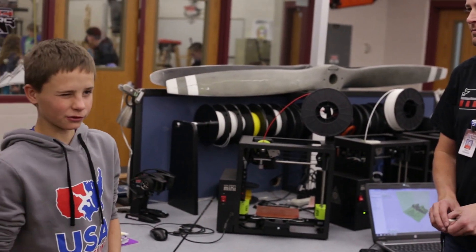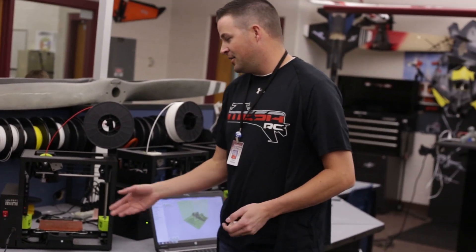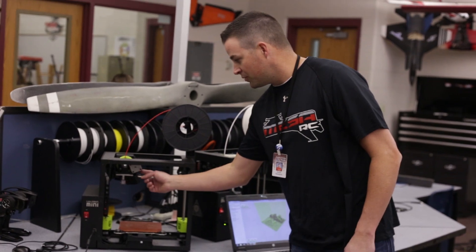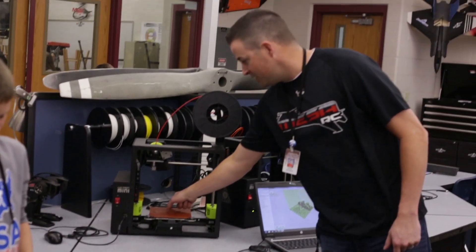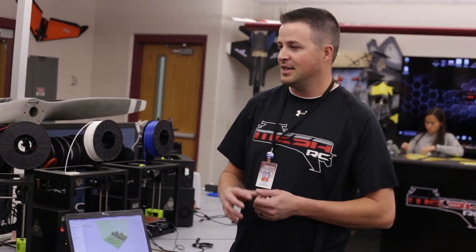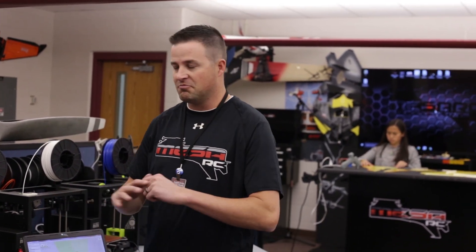I tried like three or four jobs and they would just continue to peel. The other cool thing is that when it starts, it does a self-leveling. The extruder will actually come down and touch all four points, make sure it's leveled, and it'll actually clean off the extruder tip before it actually starts working. That's huge. With the MakerBot, if a kid yanks on it and pulls hard to pop off a piece, it would automatically throw the bed off of being leveled. This one automatically levels it — all he has to do is click print.